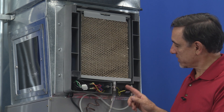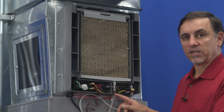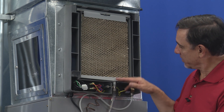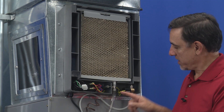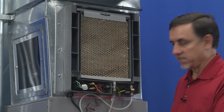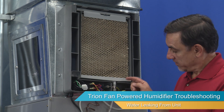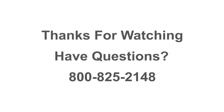Last but not least is this drain here. You could potentially have this drain completely plugged, and instead of water going down the drain it's just building all the way up to the top and then overflowing the pan. In which case you'll need to find out what's going on with this drain line — you perhaps either have a plug in it or it's just crushed somewhere downstream from this connection. Thanks for watching. For additional help or questions, feel free to contact us.